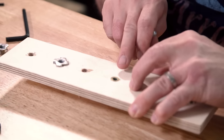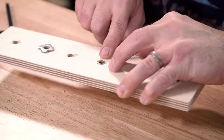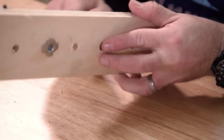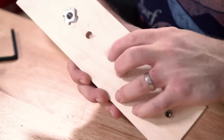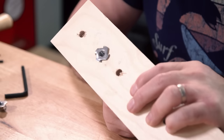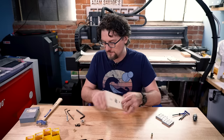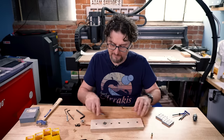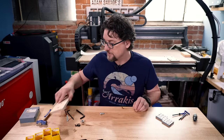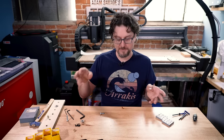For example, if you're worried about this pulling out of the wood, you put the flange on the back and then thread it from the opposite side. You then have the additional strength of the flange that makes this far less likely to pull out than just the blades on the outside alone. Those are the ones I would get versus the T-nut, and you can usually find them at the hardware store without having to do a special order.